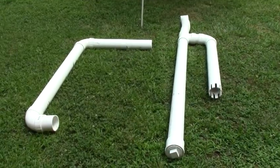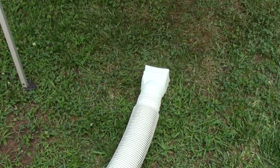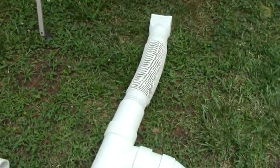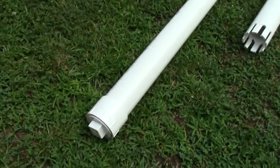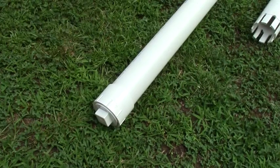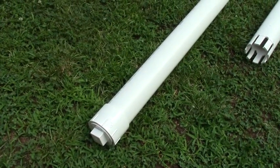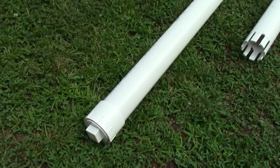Let's go over how rain catchment and this first flush diverter system works. We're going to start up at the top — this flexible downspout pipe connects to a gutter. I'm going to cut off my gutter up higher and above the rain tote. So the water comes down the gutter, enters the flexible pipe — I use that typically to get around a corner or to hide the rain tote. The rain comes down through that tee right there and then comes down and gets stopped by the clean out. Now this clean out section drips very slowly, like one drip a second. So this is slowly emptying the pipe, but considering the rains that we get, this pipe fills up. Anything that's heavier than water collects here.